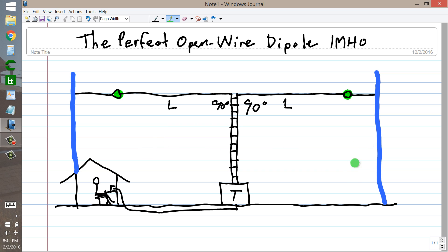Keeping the thing away from obstructions of any kind also prevents disruption of the field from the antenna. It was a model of perfection when it came to a tunable dipole that would operate from roughly 80 meters or 3.5 megahertz all the way up through the HF bands — I would say 28 megahertz or 10 meters would be about as high as anybody would ever go.